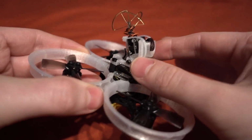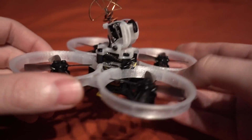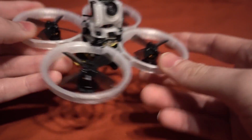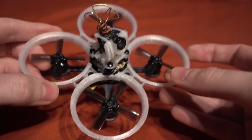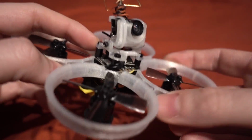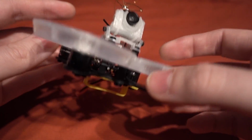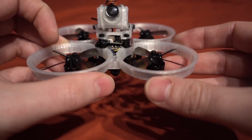But anyway, I have connected at the top here a TX03 camera, so I have just put some cable ties in there. Now Dimitri at Flex RC is working on a mount to fit this better for the TX03 and TX02, but just some cable ties there, fits in no problem. So I have got the camera routed into the 5-volt out on the Pico board there, and it is working fine, so no problem with the regulation there. And then I've also got a Lemon RX DSMX receiver in there as well.